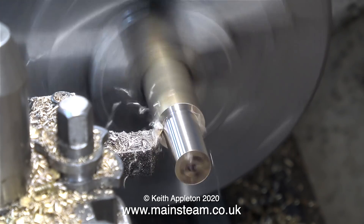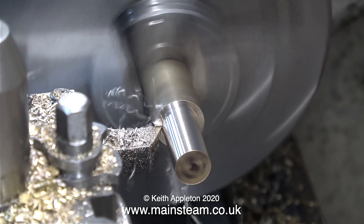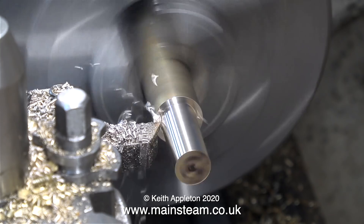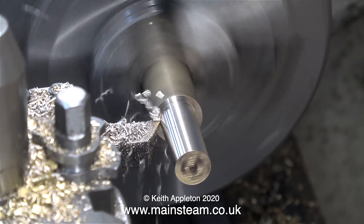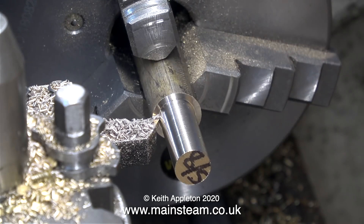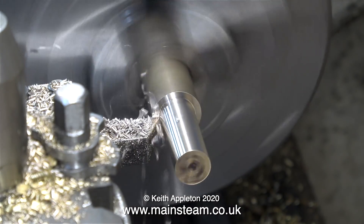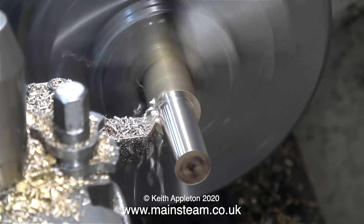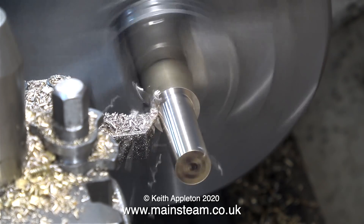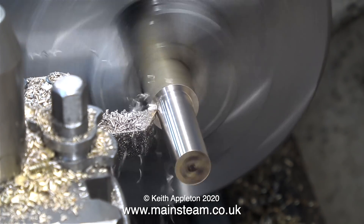The first part of the job is turning the bolt shaft. The original bar stock I'm using is five eighths of an inch in diameter. I need to reduce this diameter to a quarter of an inch for a distance of one and a half inches. In this part of the clip I'm just checking the length — quite a way to go yet. This phosphor bronze is called leaded bronze and it really does turn beautifully, quite unlike the red stuff which doesn't turn nicely at all and gets very hot.